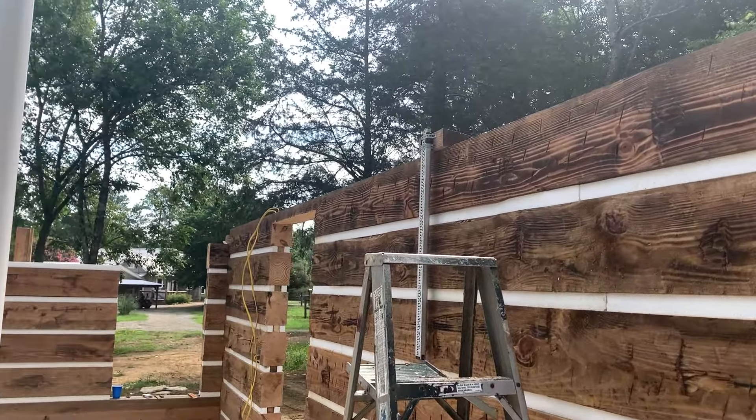Now it's time to get back to the front. I've got to run piece logs across there, and then the next one to go on is going to be a header log — it'll go all the way across after that. And I'll bring these sides up, get everything up to this level that I've got on the back of the house. And then that last course, I'll cut in the joist section of the trusses that I'm going to build.